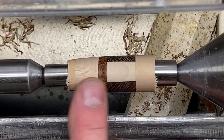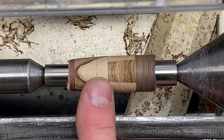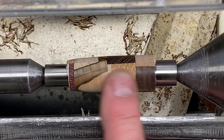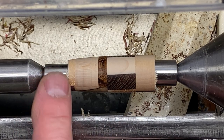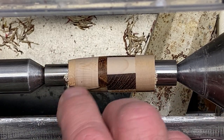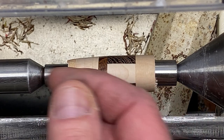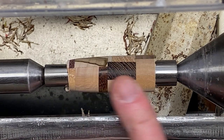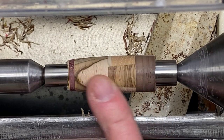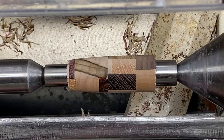So far, not too bad. I've had a couple of spots where it felt a little rough and I thought I'd better back off on the pressure because I don't want to lift any of the grain. It is, at the end of the blank, sort of rolling the grain over — I don't want to tear that off. When I get down to the bushing I should be able to ride right off onto it and we won't have that problem. I'm going to go ahead and strop my skew so that it's nice and sharp and take another couple of passes on this blank.